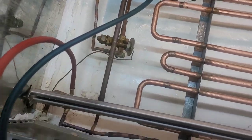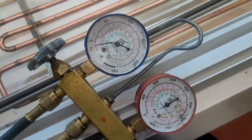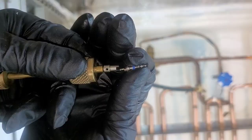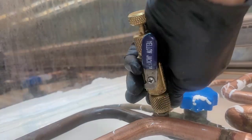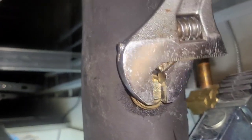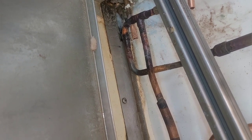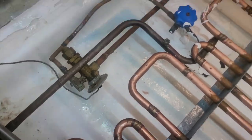This is on a huge rack, and if I got any moisture sucked in there it's no big deal — it'll come out. That's a good enough vacuum for me. So we're going to release these lines, open the valves, take it out of defrost, and charge the rack up. See how much ice is still up there? It's a lot — I think it's been in defrost for about four hours. All the rest of these coils are going to start leaking too.